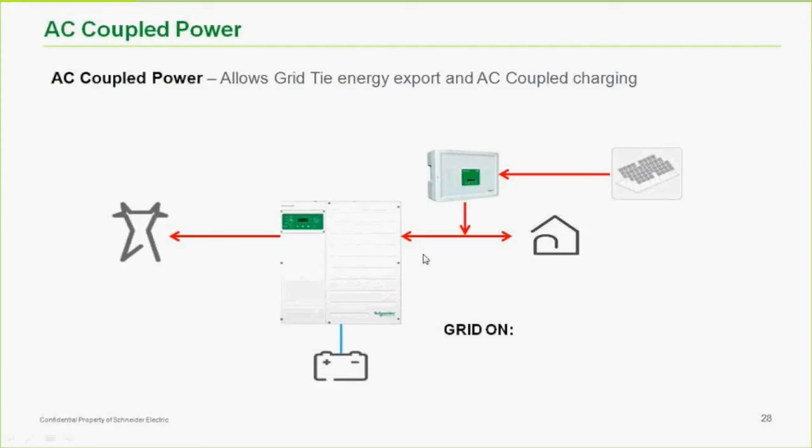Second way that it was done was something called a diversion load. And a diversion load is nothing more than a programmable load tied to your battery bank. So you have some kind of a voltage-controlled relay that turns on a load that is sized, well, actually a little bit larger. The rule of thumb I've always heard is 125% of your renewable resource. So in other words, if this was a 5K inverter, you'd want a 6K load, a very dependable load, tied to the battery with some control to turn it on by voltage. So when the battery voltage tried to go over a particular voltage, we turn on this 6kW load, bring the batteries back down to the desired level. That's what diversion load is.